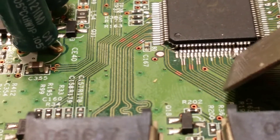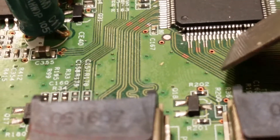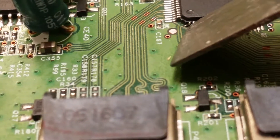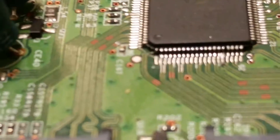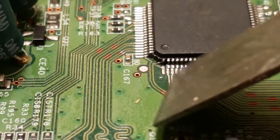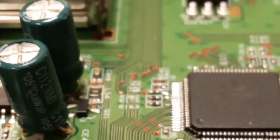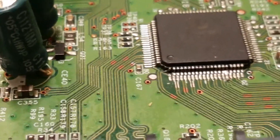And now it is twisted the other way. It is just not soldered at all. This illustrates that this IC has been replaced. So whenever that board was sent and they soldered it, they didn't do a good job. You can actually see another one that is twisted sideways — I only see it now. It is entirely possible that those legs do not make any connection at all. We will have to take that IC out and replace it, and we will have to search for other problems.